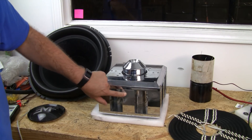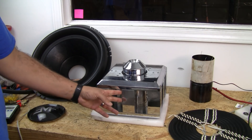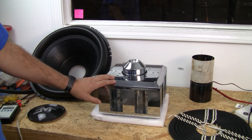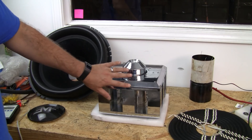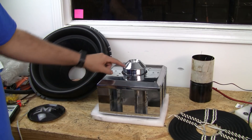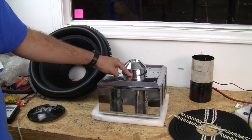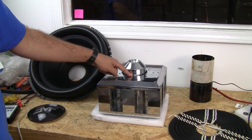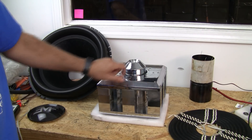This is a neodymium magnet. On every motor you're going to have to have a magnet — it may be ferrite, might be neo, there are a couple other different types as well, but they're typically not used in subwoofers. We have a north pole and a south pole. This is actually going to make a circuit that goes through the motor, and this gap right here is where the motor strength actually is. The ideal scenario is to have as much as possible right here and not have it stray anywhere else — you want everything focused in this gap.